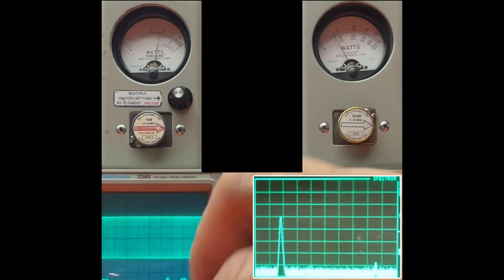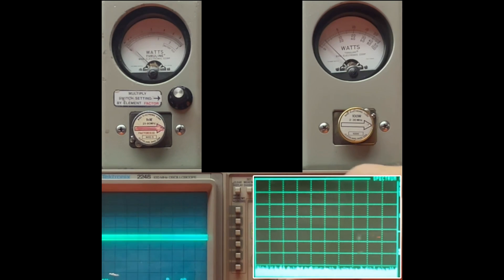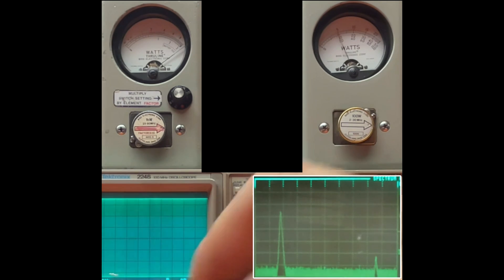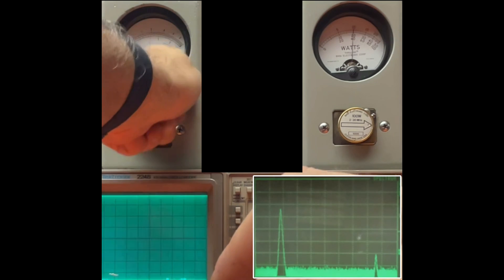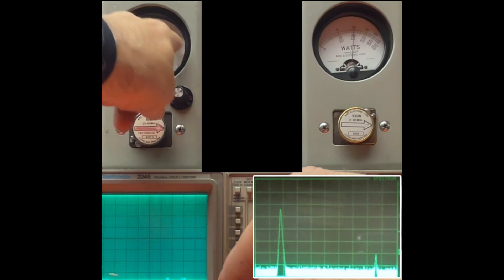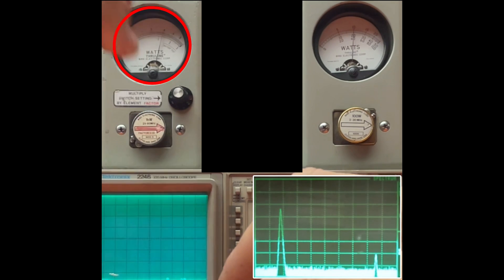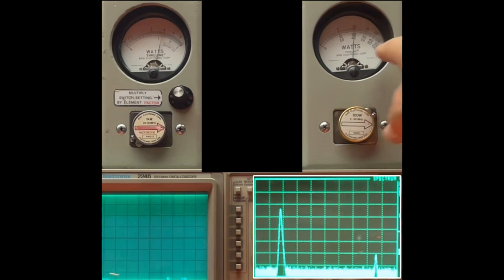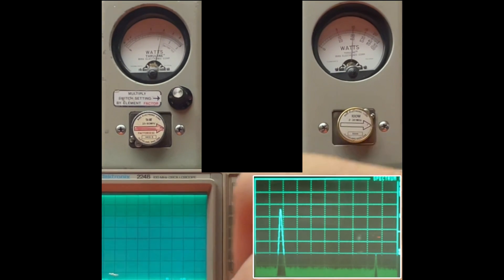Go all the way down again. Since we're on carrier, we'll look at FM. You see FM comes up with zero — just enough to move the scope, but nothing on the wattmeter. Turn it all the way up. Now I'm going to go to the 100 watt scale on the top here — that's about 40 watts of FM. And you can see the same 40 watts over here on this wattmeter. It's a peak reading wattmeter; we're not peaking anything right now.